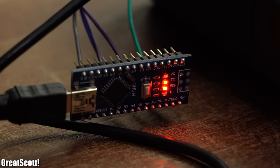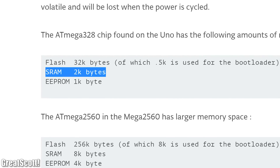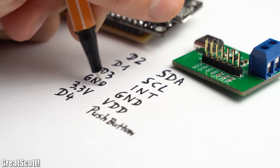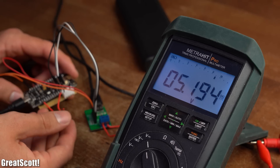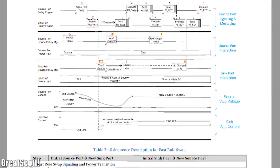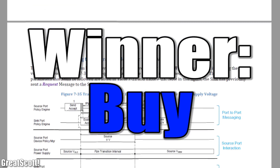After uploading this code to the Arduino it did not really work — there was not enough SRAM. So I grabbed an ESP8266 board, edited the code a bit, and connected it to my breakout board before uploading. Due to the bigger SRAM of the ESP, everything works fine. This brings me to the conclusion: I hate to say it, but due to the sheer complexity and required space of USB Type-C PD negotiation, Buy is this time the winner.